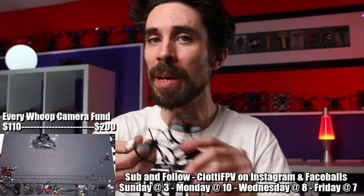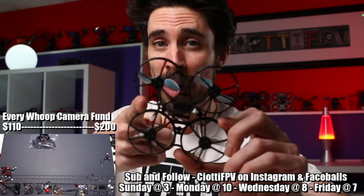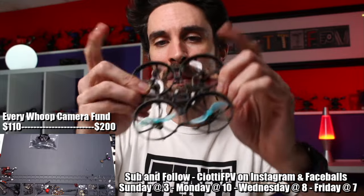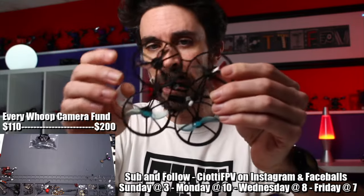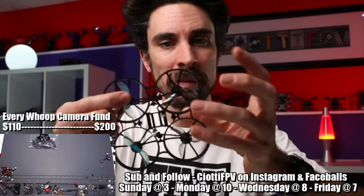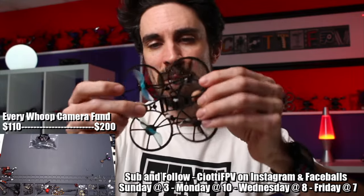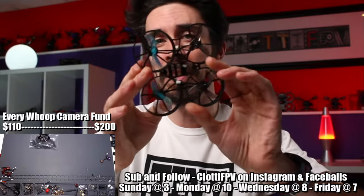At that point, to be honest, you can also think about the Meteor 75 Pro frame, and then you run the 45mm props. These 45mm props really woke up these 1002s for me, even though this frame is a lot heavier, and these propellers are a little bit heavier than the regular 1.6 inches. If I was going to run 1002s on a 75mm rig, it would be here. It would be this setup.